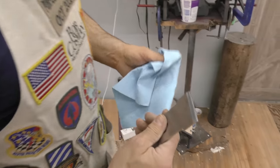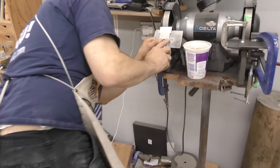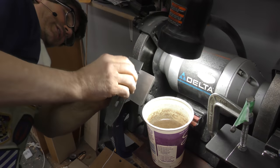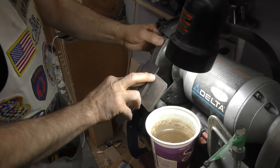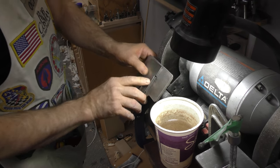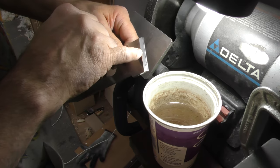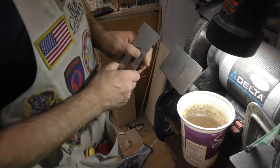See how big my secondary bevel has gotten? So I'm going to come in, I'm going to regrind. And what I'm doing is setting up my tool rest. So I'm just going to spin that by hand. Okay, so there you can see where my marks are. And that's pretty much right in the middle. If you were to divide that primary bevel, it's almost in the middle.